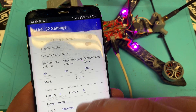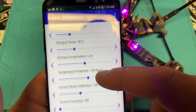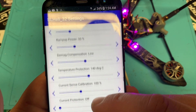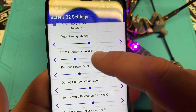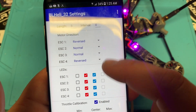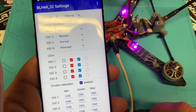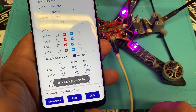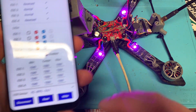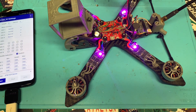I'm going to leave it like that, and we're going to rock some pink props. Now, you can also mess with all this other stuff. I'm going to leave it, because I started messing with some of this frequency and timing. We will do the frequency up to 48 kilohertz — I feel like I was having some problems. So we will write that. We are good. Let's disconnect, pull that guy out.